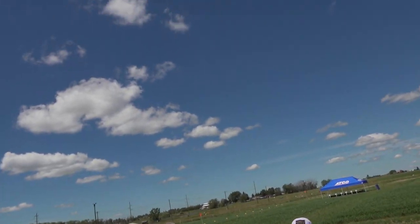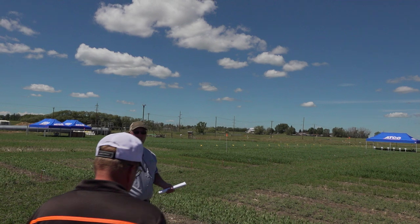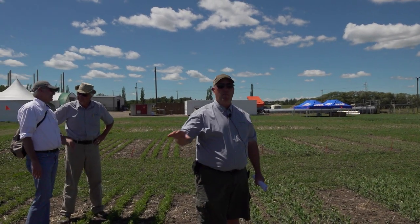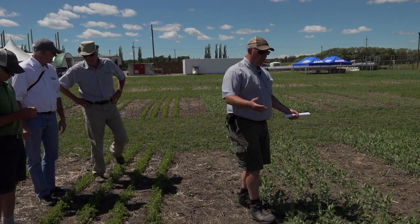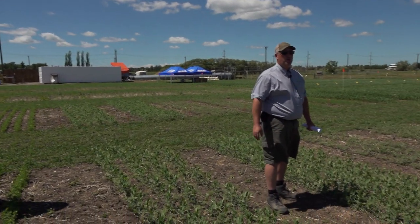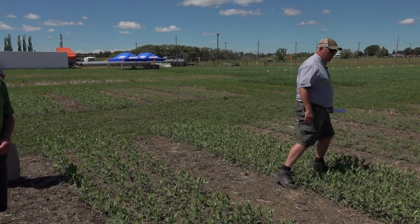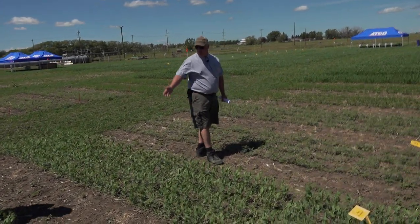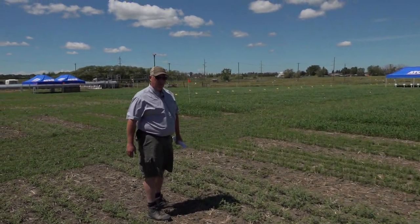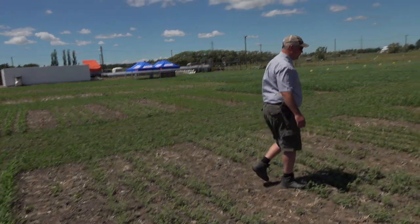As we go across all of these plots, they were all done with the planter. When I spoke with Monosem the company, they had never done this before — they couldn't even tell me what plates to use. We were able to make up the right discs to get some decent seeding rates. I'm pretty confident we can cut back on all seeding rates by about 25 percent when using a planter — that's a general rule of thumb. We've got peas, chickpeas, and flax here too.